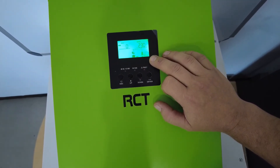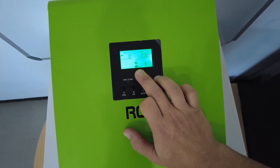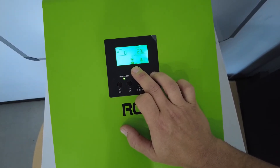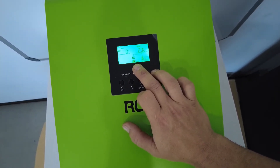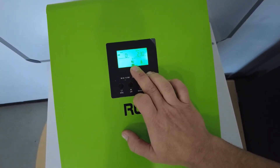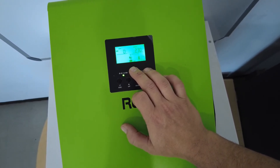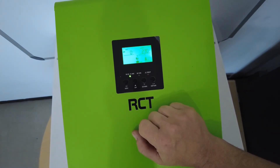The telltale sign that communication is up and running is to look at your battery icon. The battery capacity bar stays solid and on, while the outside line of the battery icon is flashing. That flashing outside line is your telltale sign that BMS communication is up and running. If the battery is charging, the capacity bars will run from bottom to top as it charges, but the outside line flashing confirms BMS communication is active.